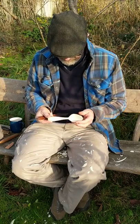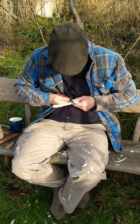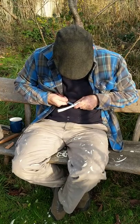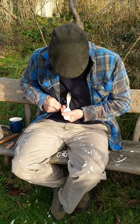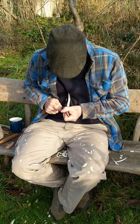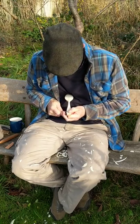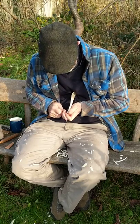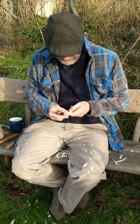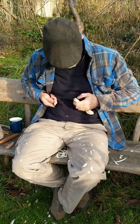I'm going to work the handle a bit more — a little bit thinner and a little more rounded. I don't like sharp edges here; they can look quite cool but they can be a bit uncomfortable when you're holding. This little section is kind of best rounded. Chest lever again to cut across that end grain.